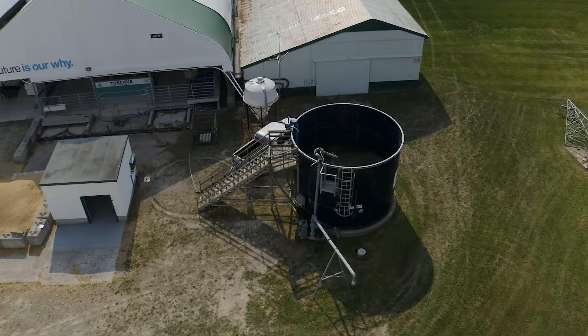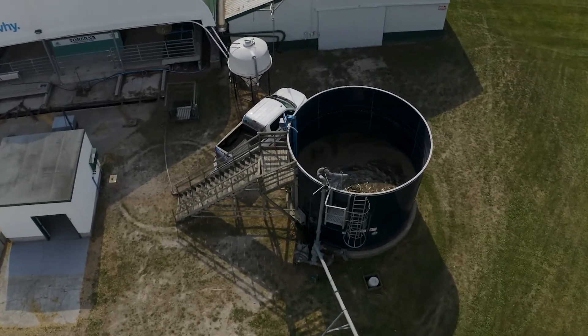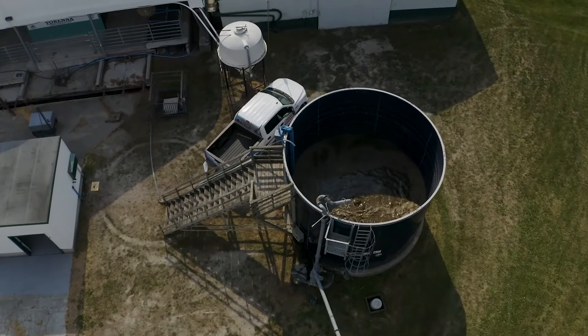It's essentially capital equipment being put into your storage system. From our experience right now, we've got about 3,000 tanks worldwide — a little over 3,000. The oldest one that was commercially sold is over 26 years old now, and we've not had to do anything. The only maintenance required with this system is on the blower motor. Every six to eight years you're going to need to change the drive belt, which is a very simple, straightforward task, and oil the gearbox periodically. Other than that, you don't need to do anything at all with the system.